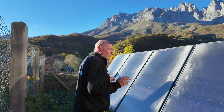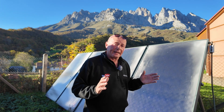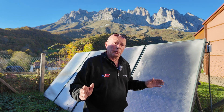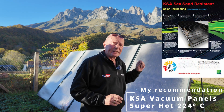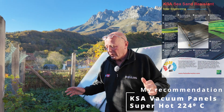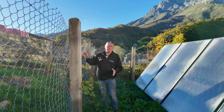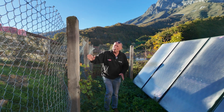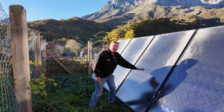We're here in front of the panels, and I want to explain some of the basic faults I see. This is a campsite area, which means you do not want items like this accessible to the general public, or children especially, because some of this pipework can get exceedingly hot — these panels are so efficient, especially at this altitude. They have put a guard area with a fence to stop anyone touching the panels, but these great big posts are actually putting shadows on the panels all day.